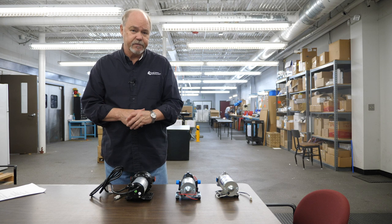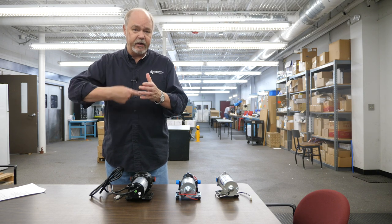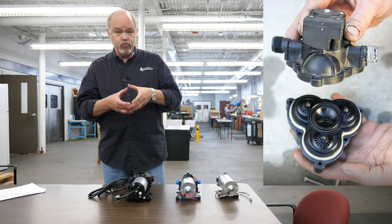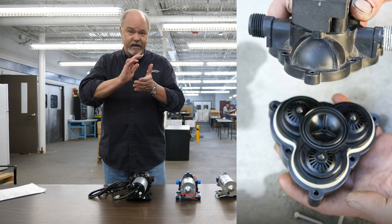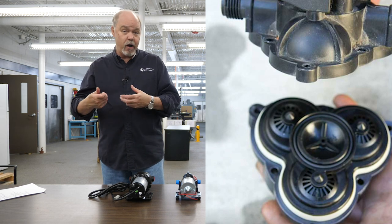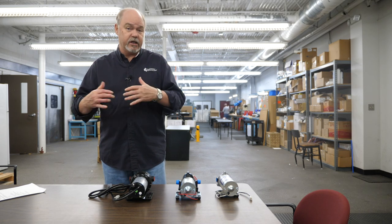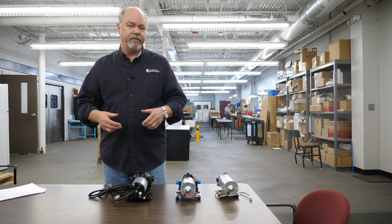These are diaphragm pumps. Unlike a rotary vane pump where an impeller spins in a chamber to move water, the diaphragm in the head of these pumps works on an oscillation process. Two rubber diaphragms with cups oscillate, squeezing and pulling apart to create the draw and push. They're typically self-priming and can run dry briefly, but it's not recommended to let them keep running dry as the pump can overheat and damage the motor.